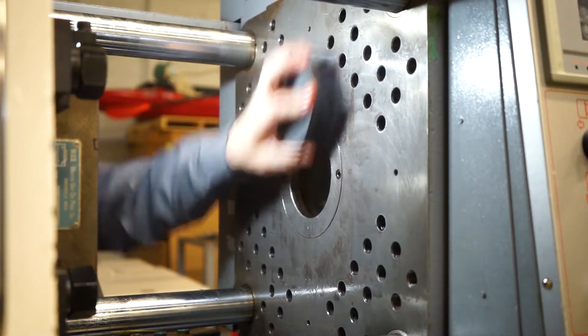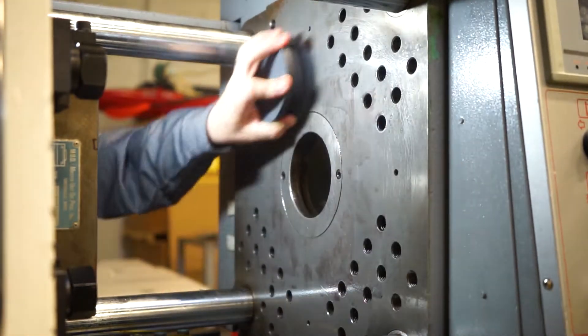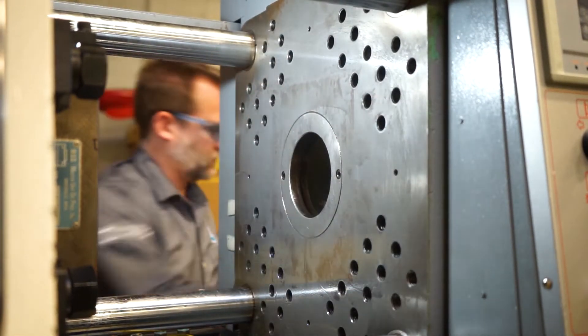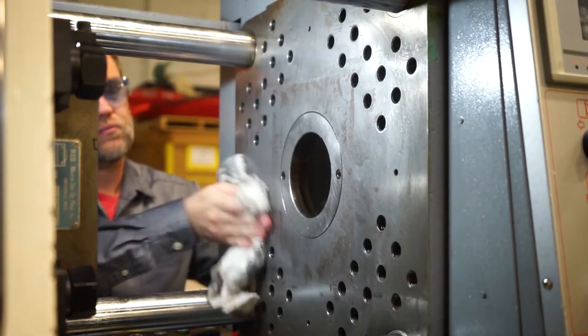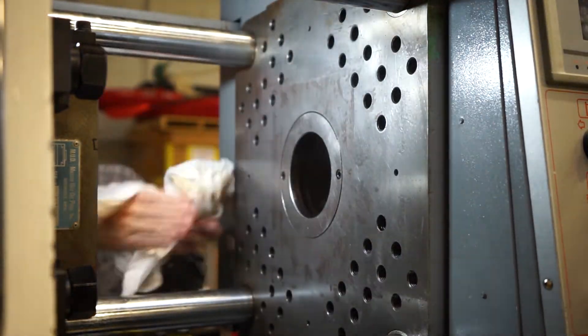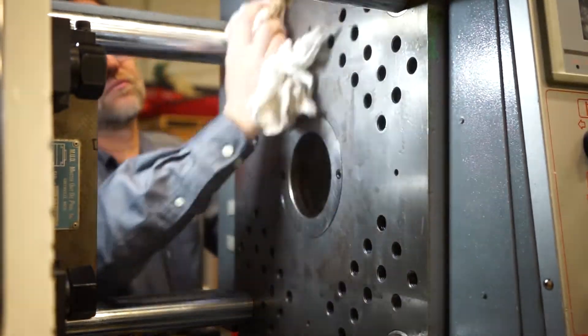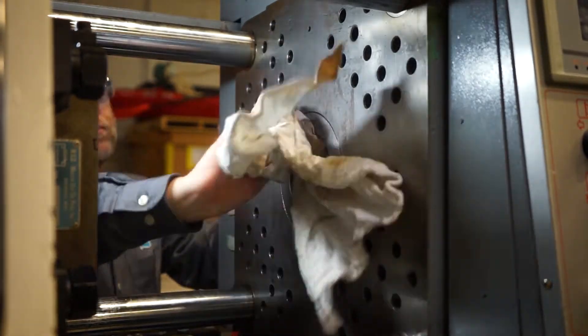Any high spot — it doesn't take much, just a few thousandths — those are the same dimensions as tool room shims. If you have a thousandths of buildup of crud on your platen, you're basically shimming the mold. So you want to keep these things as clean as possible. I finished with the fine grit side, gave it one last wipe, and now I'm going to go around to the front/operator side and make sure I get those areas nice and clean too.